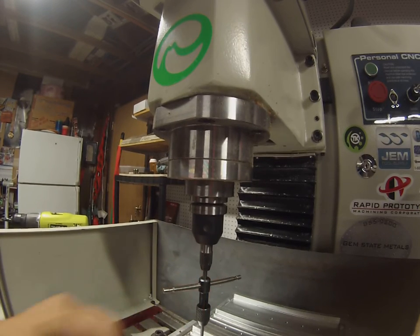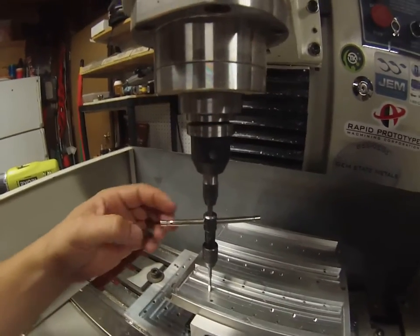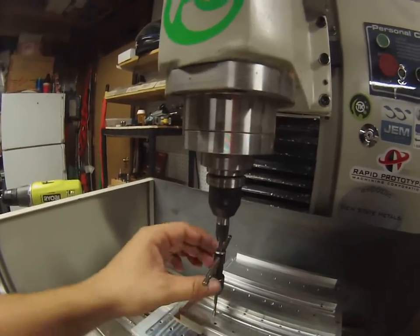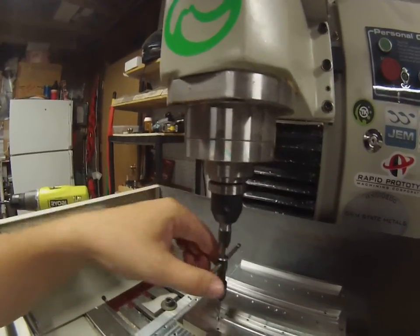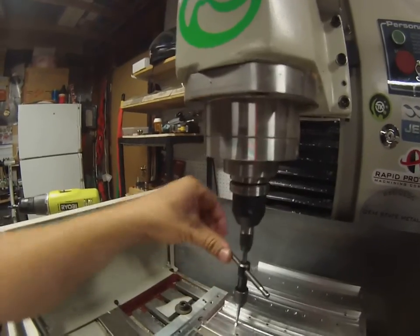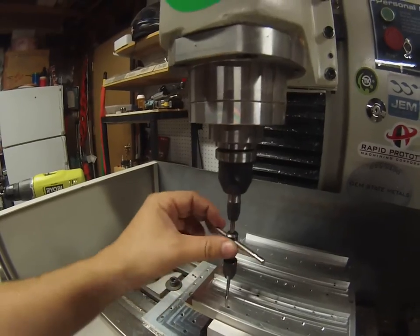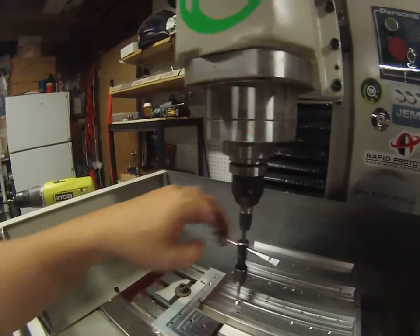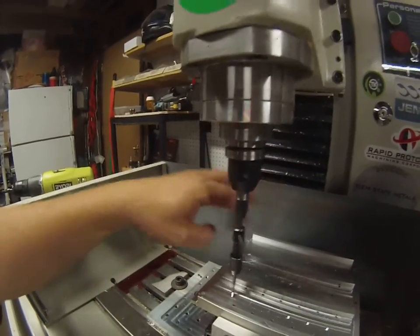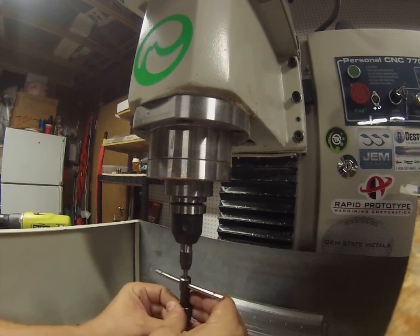It's already centered up on the hole — you can see it's centered on the hole, it's spring-loaded, it's all good to go. I can just tap it by hand and the spring tension will keep it pressed in the hole and keep everything lined up and straight. Even if it happens to come out of the collet — you can see right here it's actually not attached anymore — that's all right. As long as you get your first few threads in, it'll start tapping straight and after that you'll be fine.